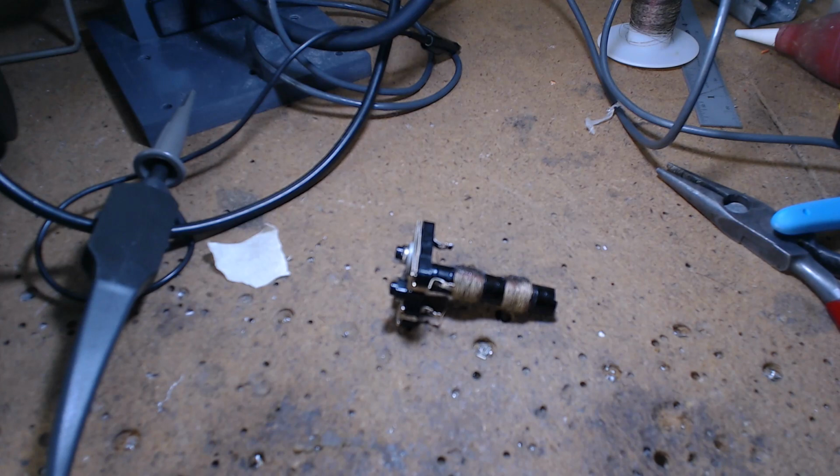I just wanted to tell you, I did figure on this thing needing to be higher in frequency. And that's why I said the word fast on those tuning capacitors. You would not use those normally. You would use ones that are maybe, instead of 150 picofarad, a range of maybe 25 picofarads. Right? But I used those because that's what came with that bobbin.